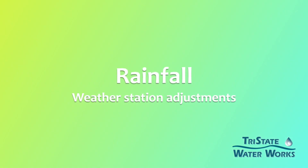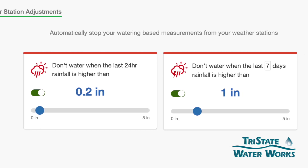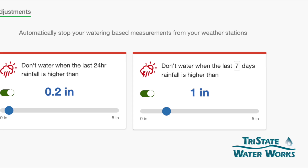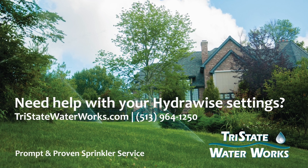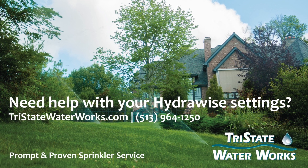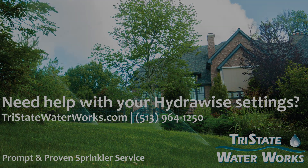There's one more section below that looks at rainfall. One is don't water when in the last 24 hours rainfall is higher than two tenths of an inch. Or don't water when in the last seven days the rainfall is higher than an inch. All of these things can be set up and manipulated to save water. So if you feel like you're getting too much water or it's watering too quickly after it's rained, here's where you can go in and change those parameters to dial it in and make your system specific to your site and location. Thank you very much.